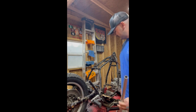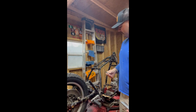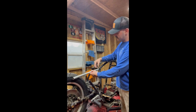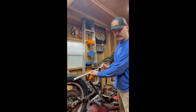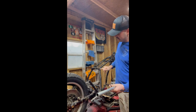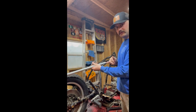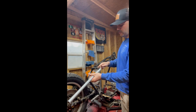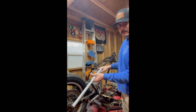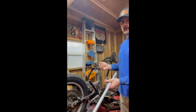But we essentially want to put something in it. This is just a punch, this is not what we're gonna use. This is gonna go in there, the tube slides over it, and then that will support that joint. That plug will be welded to both the inside of this tube and the inside of this tube through a rosette weld. And then we're also gonna weld the circumference of the tube in that gap. So there's a lot more surface area that's being welded and holding that together, and that'll ensure that structural integrity